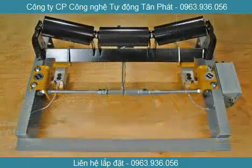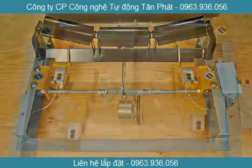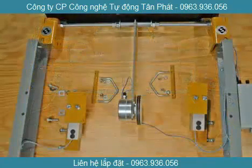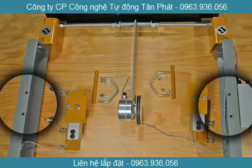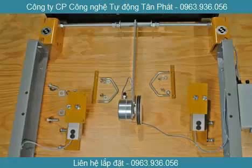The next step is to locate and cut holes in the conveyor stringer to mount the belt scale using a drill or torch. Four mounting holes will be needed, two in each stringer. The stringers should be rigid enough to support the idler and the material load without deflection.